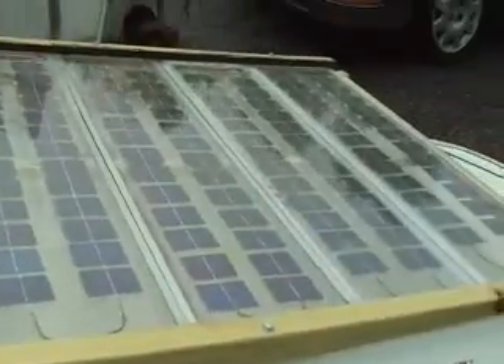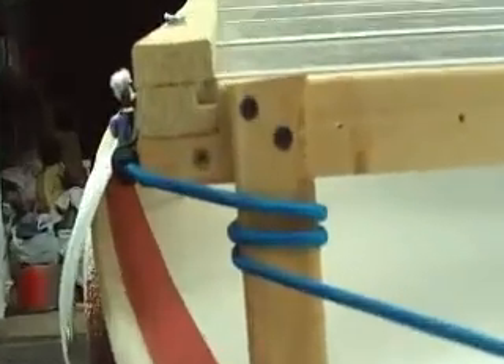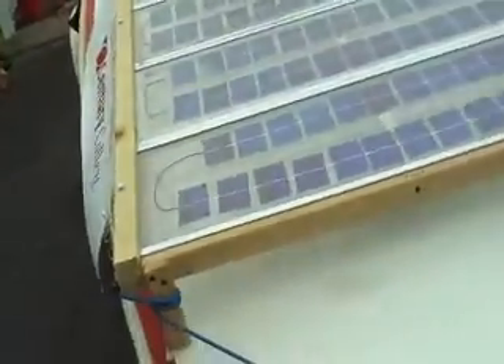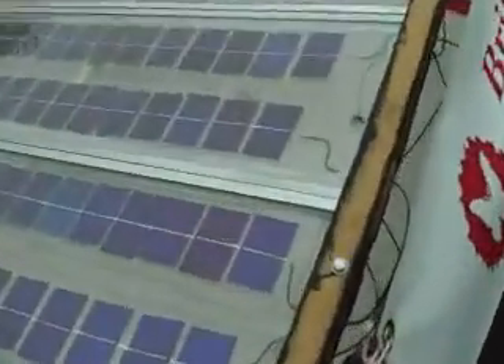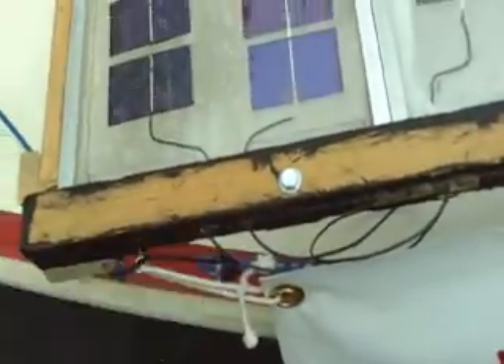This is my solar panel array. I don't know if I ever really got to do a good close-up of it, but they all butted up against one another. I was able to use the router to route out a channel down through there, then chop the boards up in half and used some lag screws to affix them together. That allows me to use wrenches or sockets to rather quickly interchange panels if need be. I used a radial arm saw to cut these little grooves for the wires to come out of. It actually worked rather well.